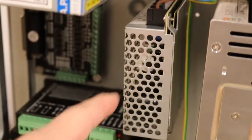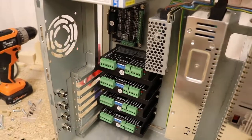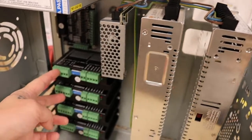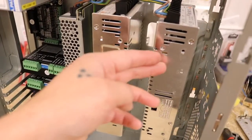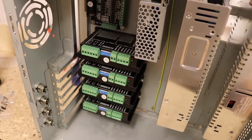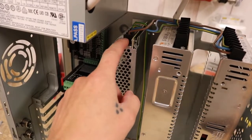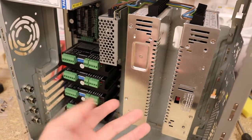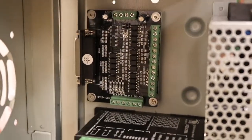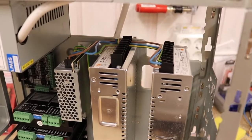I've also got a 5-volt PSU right here, so power is also going from there to this PSU so that I can get 5 volts to the electronics that need it. And this is the drivers. This PSU will be powering two of these drivers, and the second PSU will be driving the other two, since this is a 4-axis machine. Most of this was bought as a kit — the whole idea being to drive two drivers on each power supply. The high voltage side is running at 240 volts.